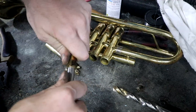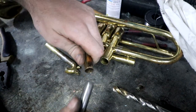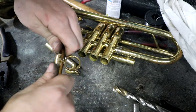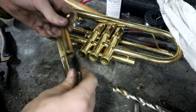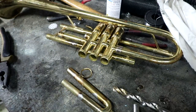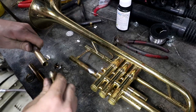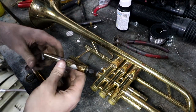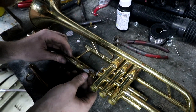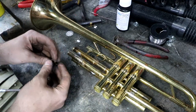It's round — that's working better than expected. They still slide. I've just cleaned all the solder off all these bits. What I'll do now is assemble these in the order they came off. That goes there — I think we should be able to sit this all together and slide all these little reinforcing pieces into place, then heat it up and add the solder. Actually, I'll add the flux first — then heat everything up, touch the solder to it, and it should all solder back together solid like it was brand new again, but slightly more burnt looking.